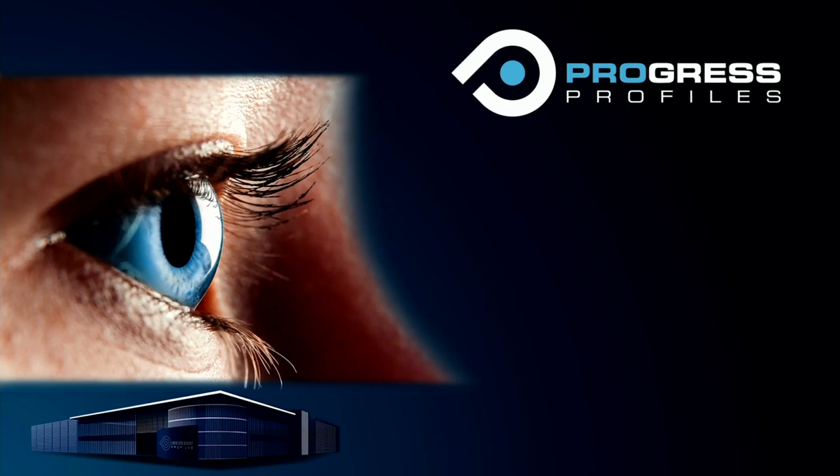Our system is designed around two products: the panel and the wedges. The wedges are 36 by 36 panels in XPS. And Brandon has one of those. They start from half an inch. They go up to 1.25 inches. So there is a 1/4 inch pitch per foot.